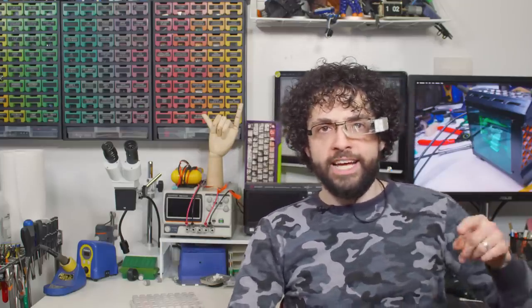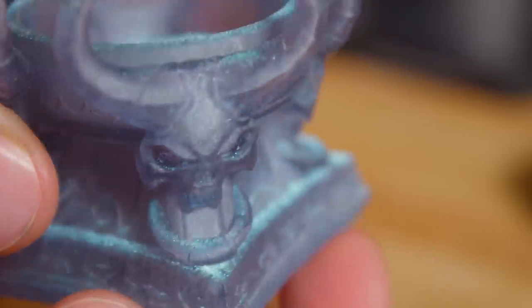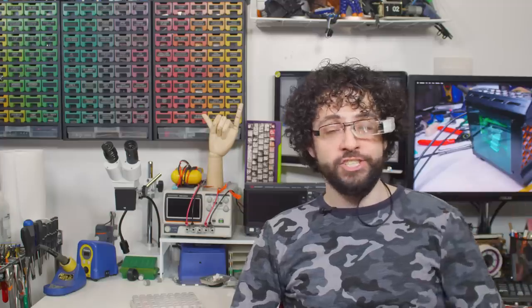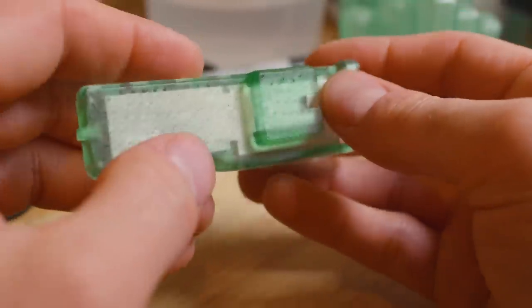This is one of the coolest parts of 3D printing with resin. If you're printing with filament, your print is going to be 100% stiff PLA, or 100% saggy PETG, or 100% stringy TPU. But with resin you get to mix the perfect blend exactly the way you want it. Standard resin also distorts a little as you print — the dimensions you get aren't exactly what you put into the model; it's actually the resin that's inaccurate, not the printer itself. For a lot of projects this doesn't matter, but if you're printing functional projects and prototypes you're going to need tougher stuff with tighter tolerances.